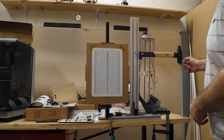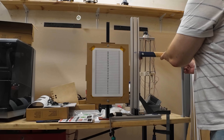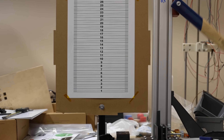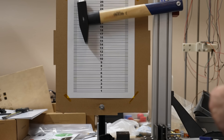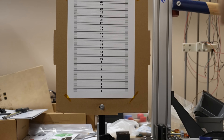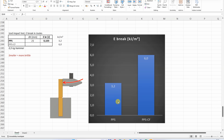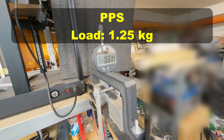The impact test with a half kilogram hammer. Zero position. This is a slow motion footage viewed from the second camera. These are the edge positions of the hammer — distance from zero position is 21 millimeters, and from this I can calculate the breaking energy. And even if it is called toughened, this is still more brittle compared to the PPS-CF.